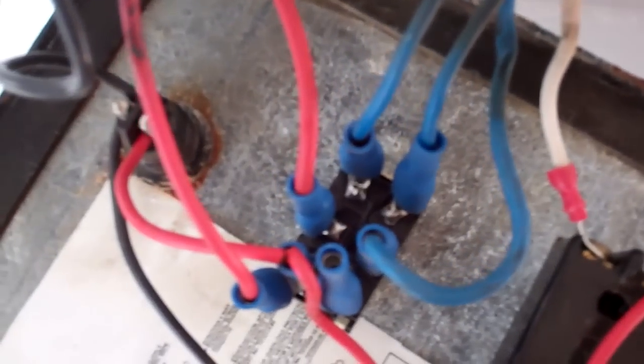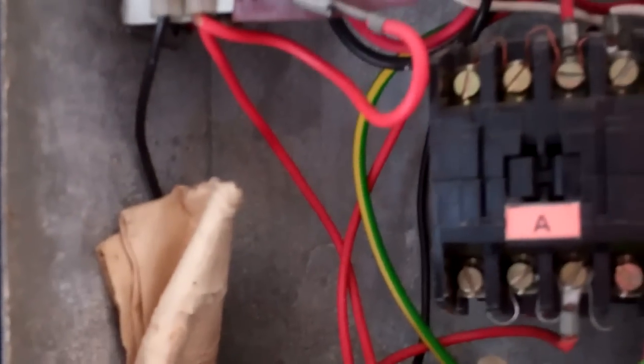The power for the thermostat comes into the switch in the centre, comes out on that wire, lights up the green light, should be on, tells you it's on, power's on, and that puts power up to here, which is the thermostat feed. Also comes up this little timer, comes off of that timer and goes onto the coil, or it can go up the thermostat wire, return from the thermostat wire, and then go to the coil. So either that or the stat can bring the contactor in. And there'll also be a manual on there from that switch, as well, on the blue wires.